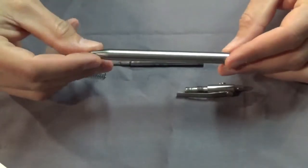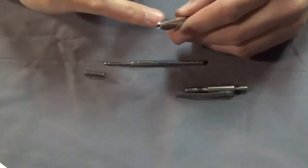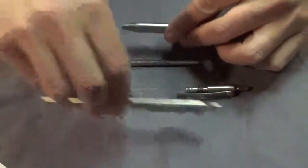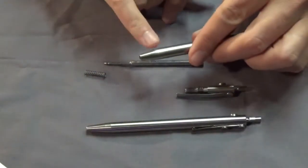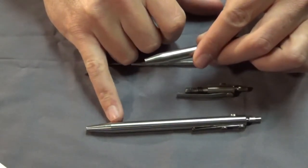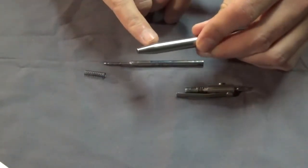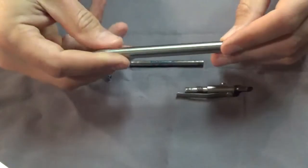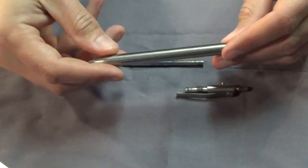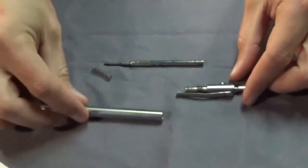So this is just the barrel body - it was half-inch titanium rod and I drilled it down. This one has a taper; I did about a half-inch taper. An earlier one I did about a three-quarter inch longer style taper. This is a little safer because the dimension you have to drill down won't accidentally hit where you drilled - it's a little thin right there. I polished this one and filed it a little smoother. I've used this pen for probably two years for work all the time, so it's a pretty robust action.